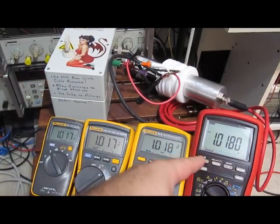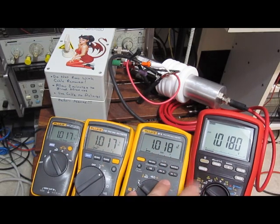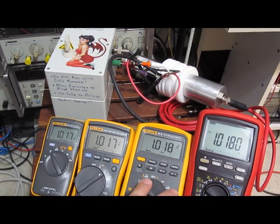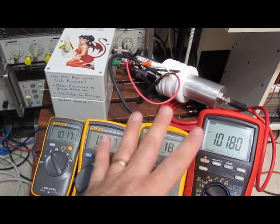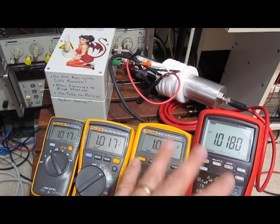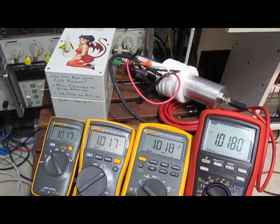But I will say, is this meter as robust as these? I mean, certainly taking it apart, it looks very good. It uses the large fuses. Fuses are rated at 1,000 volts for both ranges. Blast shields around both fuses. You know, it looks quite well built. Very large. The high voltage resistors in the front end are quite large. It has a couple of MOVs, PTCs, the standard stuff. Very well laid out. So yeah, I'm thinking it'll probably hold up quite well.